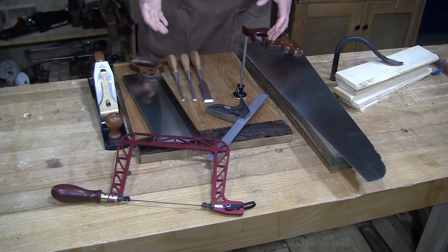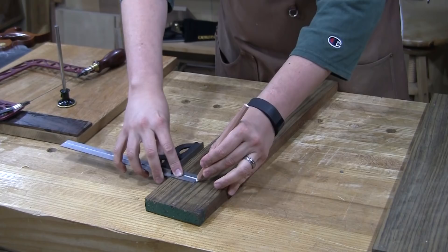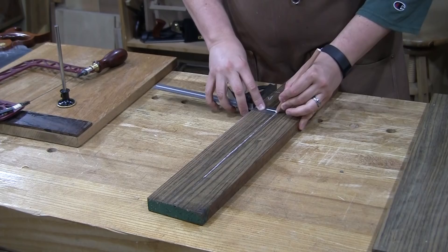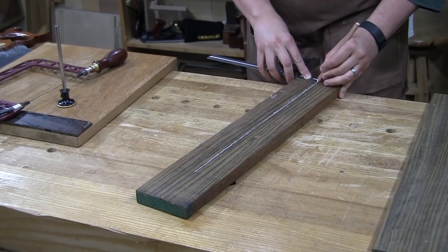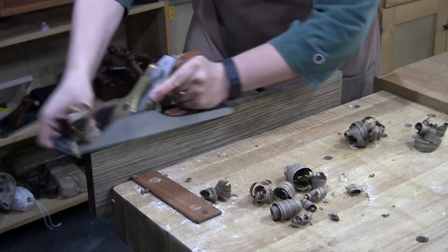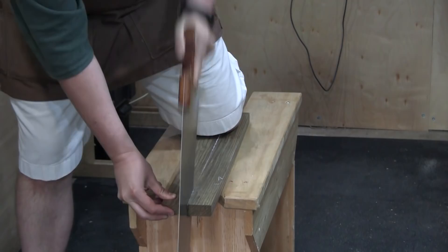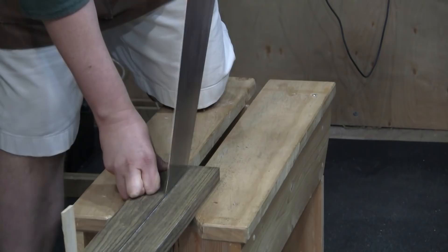And that's all of it. So rather than just talking in abstract, let me show you why I suggest these tools. I'm working on building a small wall cabinet. The sides are out of African shedua and I've got two doors out of a beautiful quilted maple. I need to rip this board in half, so I'll use my combo square to set a two-inch width and mark down this edge. I've already jointed one edge and used my jack plane to get that nice and flat so that my combo square reference is off of it. With my lines on both sides of the board, I'll use my hand saw to rip down the middle. Whether it's rip-filed or cross-cut filed, it will do the work — a rip-filed coarser tooth is going to do the work a lot faster, and that's why I think going with a rip saw is just a better idea.